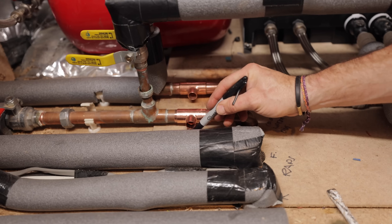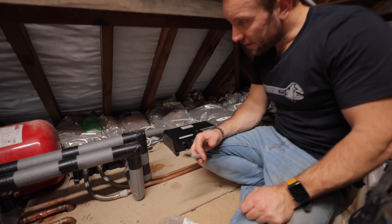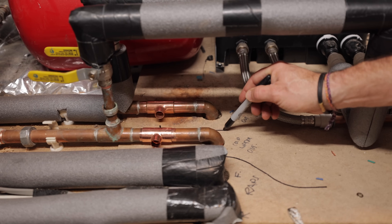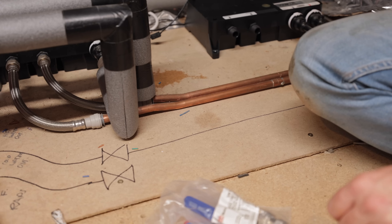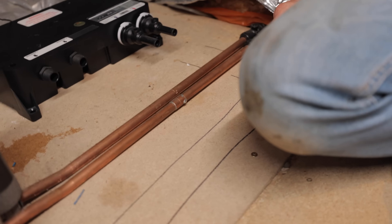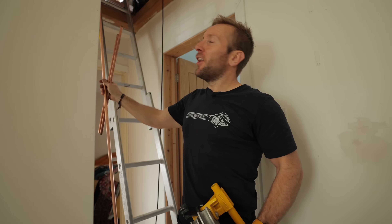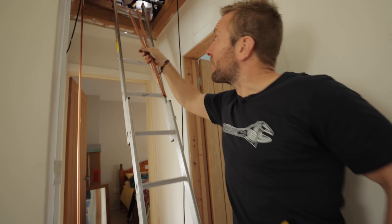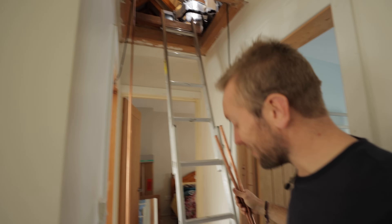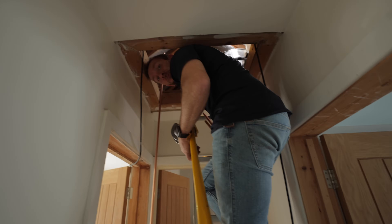So our cold is going to elbow out of here straight away, then come out over here. I need my pipe benders, which are at the studio. The hot is on the wrong side, of course - hot will come into there and the cold will come down here and go in there. A lot of people ask why copper pipe length is three metres - it's because it's exactly the right height to prop up so you can get it when you're in the loft.